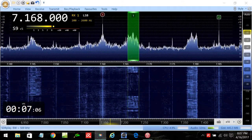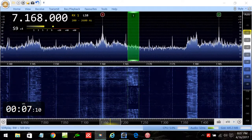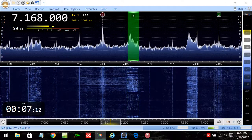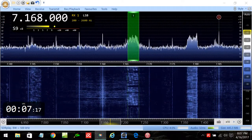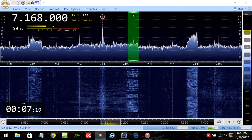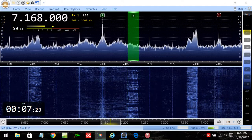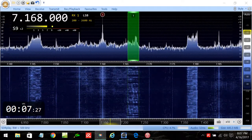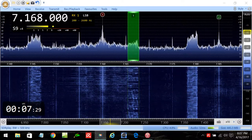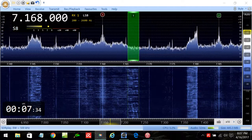And have you ever actually put an antenna analyzer on it to see what it's resonant at? Not really. I've got an analyzer sitting right here, but I've never really looked at it, going through a bypass into one of the coaxes, a straight coax into the tuner. But it tunes up good on 160 all the way up to 10 meters. So if the beam doesn't work, then I try the loop.